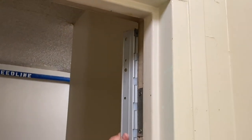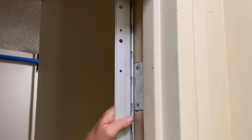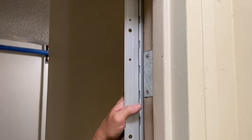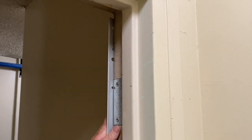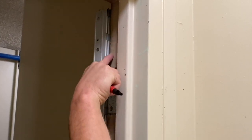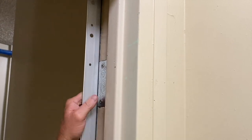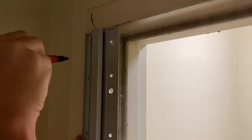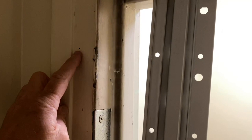You see where the hinge bends? You can actually bring this thing out quite a bit, but you don't want to go back too far — you'll lose your holes. Ideally, I want the center of the hinge to be even with the edge of the jamb if I can. I can't always control that, but right there, that's going to be perfect. What I'm going to do is just mark a hole right here. There's my first screw hole — I'm going to pre-drill that and start mounting the hinge.